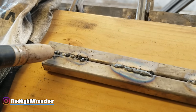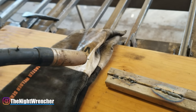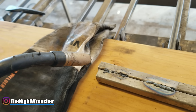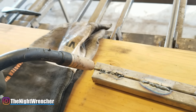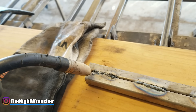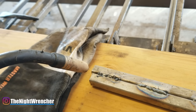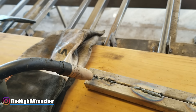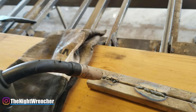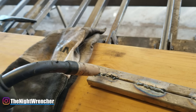This first weld — I was way too far away and I was moving the gun forward and back, simulating when you have too fast of a wire speed. When the wire speed is too fast, the wire doesn't have a chance to burn up and flow into the weld, so it bumps your gun back. When it bumps back you break the connection, then restart, then break again.